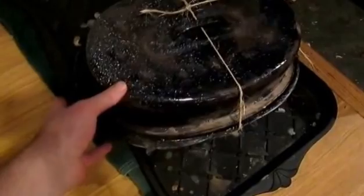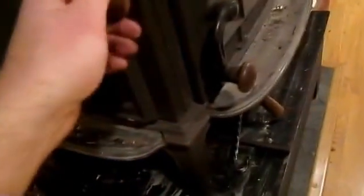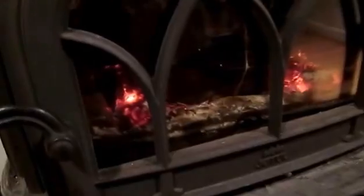I've got this container with locusts filled to the halfway mark — I'd love to fill it all the way up, but I don't know how to do that yet. I made sure the lid sat well on the seam so there's not room for air to come in, then tied a piece of jute yarn so I can load it in. I had to put it in at an angle so the lid won't fall off while doing this one-handed. With just a coal bed I should be able to put it in. The box is a little cooler than last time, but I suspect there's enough heat to start driving off some gases and have those combust.